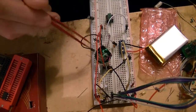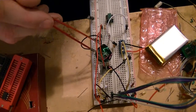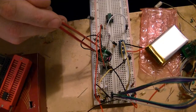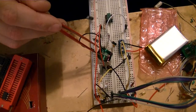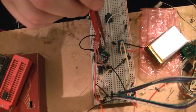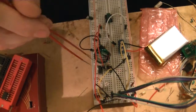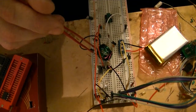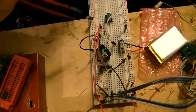You can see this big green thing here. I couldn't find the right value resistor, and then I remembered I have coils and coils of magnet wire, so why don't I just wind my own 0.2 ohm resistor — which is exactly what I did. And it's working like a charm. It took me a few minutes to figure out how much resistance there was per turn and then work it all out.